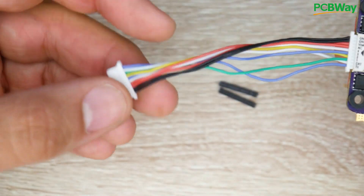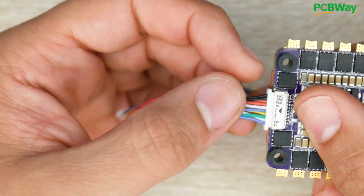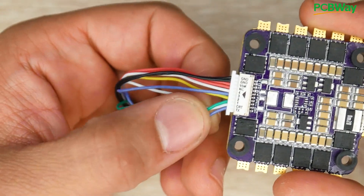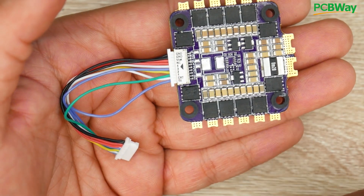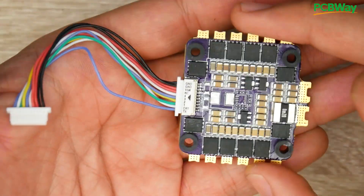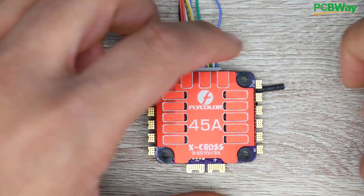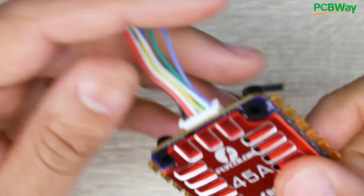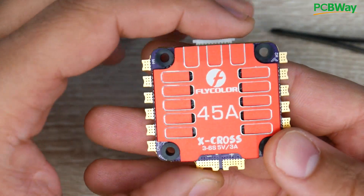You're going to want to cut this connector and use these individual wires. The last thing on the list is the TX — this is ESC telemetry. You can use it, but I would mainly use it if you're going to be running RPM filtering. If you don't know what that is and don't want to play around with it, it's not really necessary, so you could just cut this off and ignore it for now. That's basically it — it's very simple. Just match everything correctly and make sure your flight controller takes battery voltage so you don't fry it. It's a really nicely made ESC; you can even see the edge plating, which is a very expensive process and says a lot. I really hope you guys enjoyed it — check the links down below, and I'll see you in the next one.